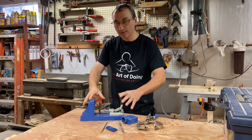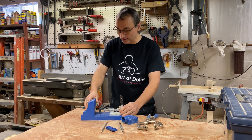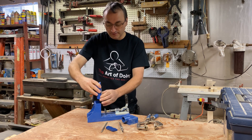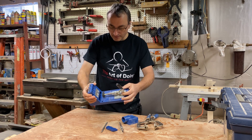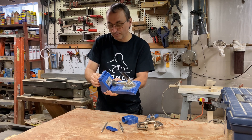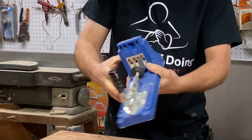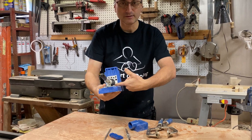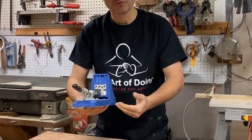If you're interested in the setup of this, I'll put a link to that video in the description as well from last week, or you can just search the channel and you'll find it. I was talking last week about how you set this up for the depth you need. If you notice — and I'll get in a little bit closer — there is a space here. When you do three-quarter wood, which is typically what I work with, you set that setting at the three-quarter mark, and once you've done that there is a space under here so you drill the hole at the right depth and don't go through the three-quarter wood.